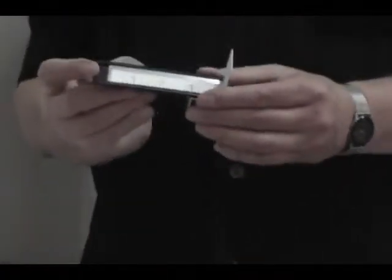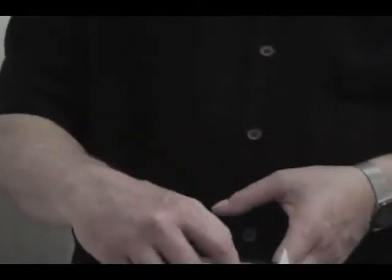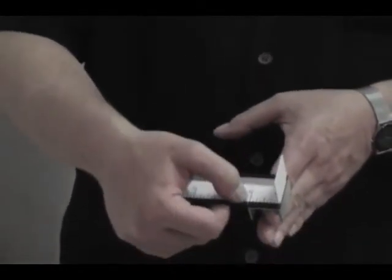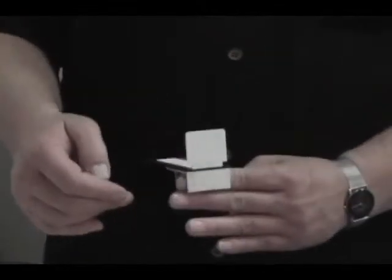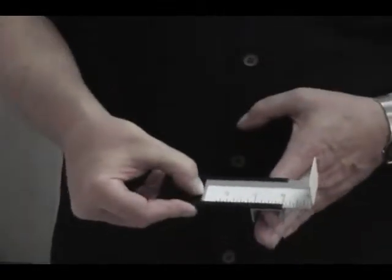Otherwise, our next most useful target is the clamp target. This was designed to both fit on a new construction cabinet base. It has a convenient 0 slot here. It matches up with the 0 there. If you clamp this on the base unit, this is the edge here or there. Okay? You could use this to do an offset of, let's say, 1.5 inches out from the base unit and hit that.